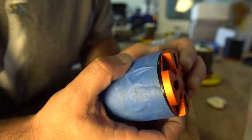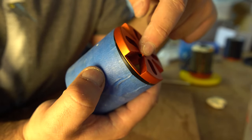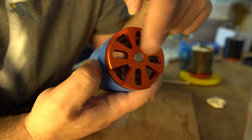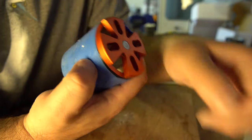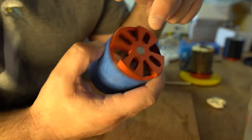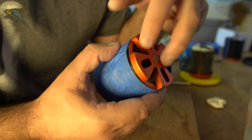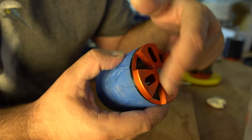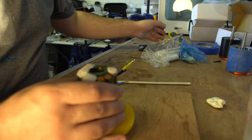The last thing to do to fully battle harden your motor is to address those grub screws we talked about earlier. You can take those out and put actual socket cap bolts in - one on each side. I don't have any with the correct thread and size right now, but removing those grub screws and replacing them with bolts is a good idea because grub screws can back out, causing the can to spin while the shaft doesn't move.